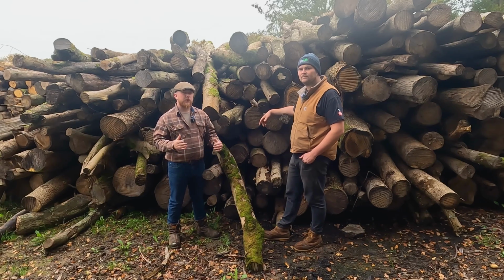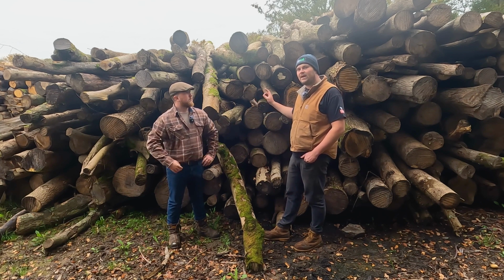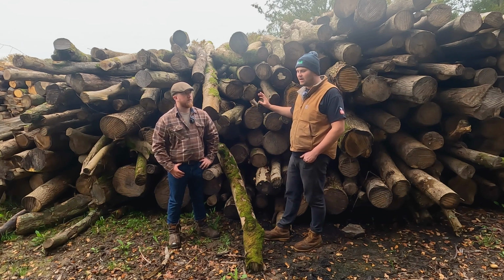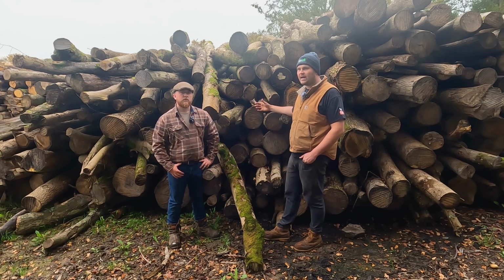So if you don't have the facilities to grade timber because you haven't, let's say, got a big machine with a grabber or anything like that, you can purchase graded timber, but it does come at a premium price. Yeah. So when I first started off, I was buying somewhat graded timber. It was all smaller because I had one processor and I didn't have any form of moving the timber around apart from a forklift. So we typically got a load into the yard and we wanted to process every single stick with just one processor. Those loads were costing slightly more than the jumbled mix I get now, but now we're going through the volume, we can take absolutely everything and make use of it all.